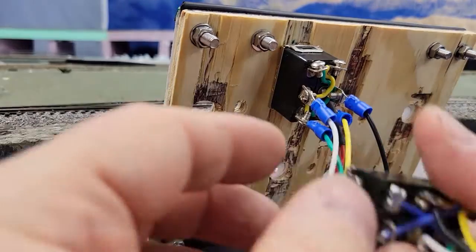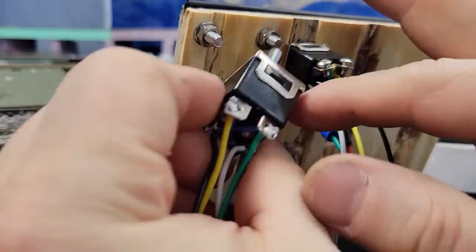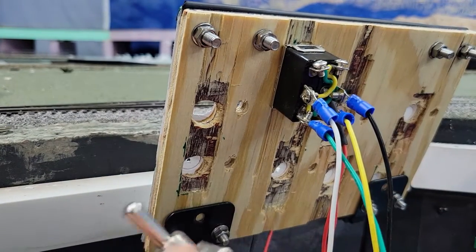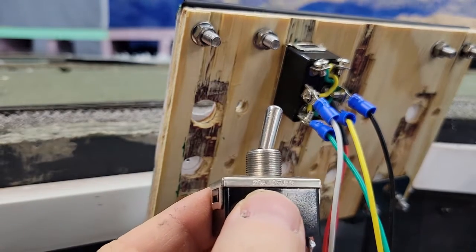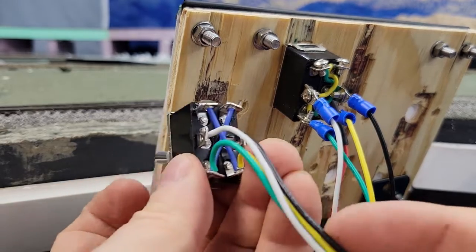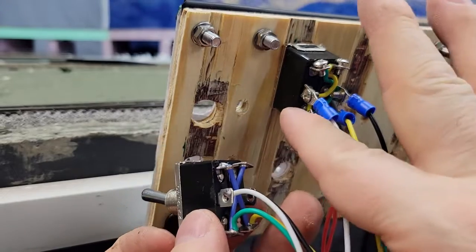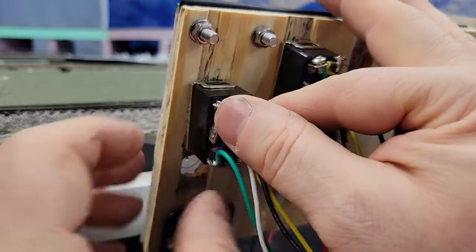When I wired these switches together, I took notice of what side I was wiring — making sure that the wording on the left says 12, 20 amps, and on the other side, 15 amp. And then I was able to position it so that my green wire is the lower left. So this is how I need to put this in.